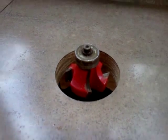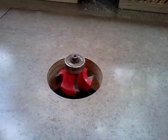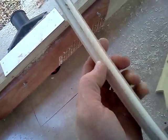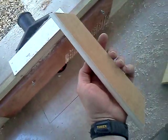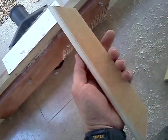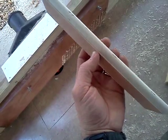I'm going to change the bit and set my fence up, and I'm going to round over a little bit at a time. I think I'm going to go pretty deep with this one. I decided to do something a little different — I just put a round on both ends, both sides of the planks, just to kind of give it that curve around at the wall instead of being flush with the wall.